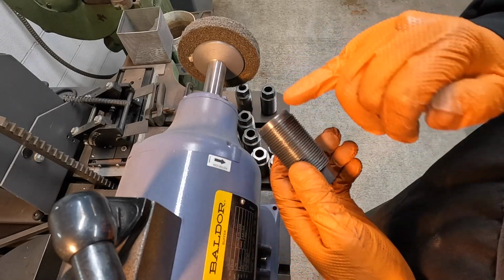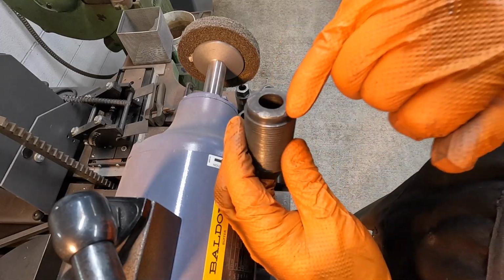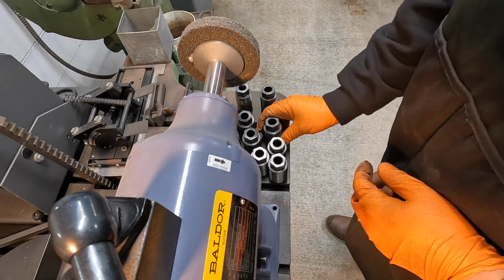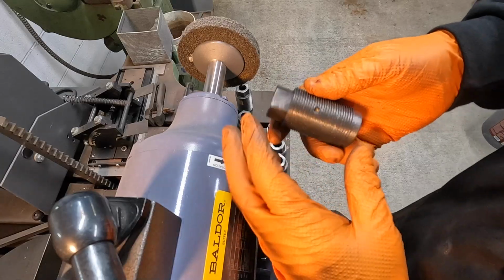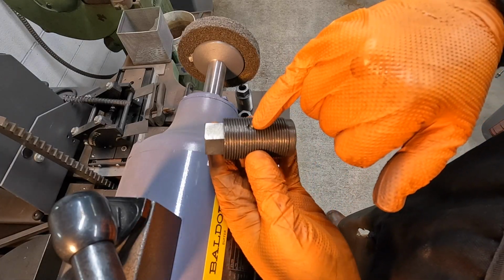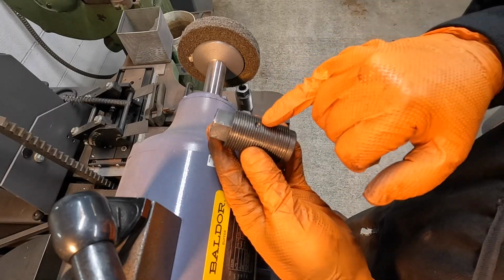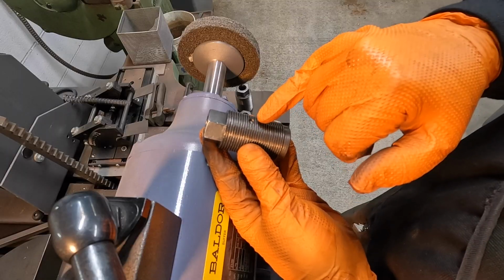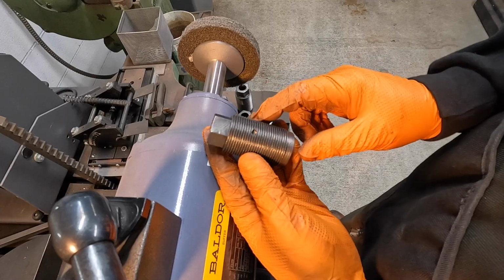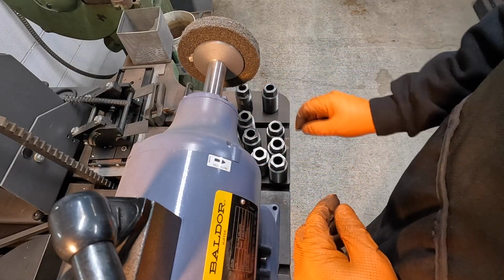So we're going to go to the lathe and clean all these guys up, make sure the face is clean. I'm not going to be cleaning up those low spots, but we're going to make sure that the faces are clean. And then when I was pulling that one out of the back side, this is the one that's been drilled, and I can't find any reason why this would be drilled. I'm just curious as to how this got there and why, because there's not a set screw in the side of the foot of the machine. So no idea there.